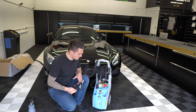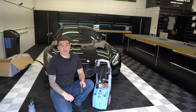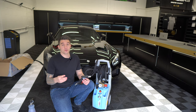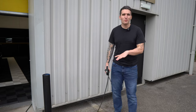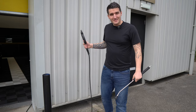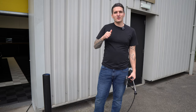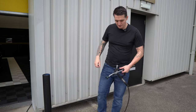There will be more videos on how to operate and maintain it. Now the pressure washer is being taken outside — the same setup — to put through its paces at the famous Torch Wall, which has seen more pressure and more chemicals than any wall in the UK. The pressure washer is lying down. The recommended startup sequence is: turn the water on first to feed the pump, then turn the power on — doing it the other way around means the pump runs dry, which isn't good for it.